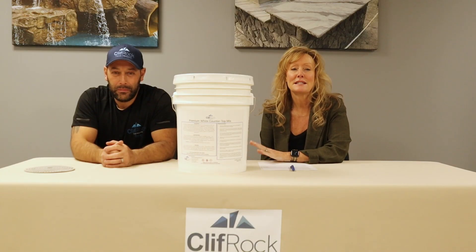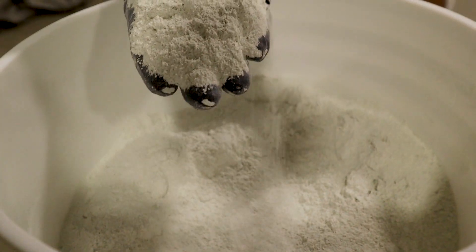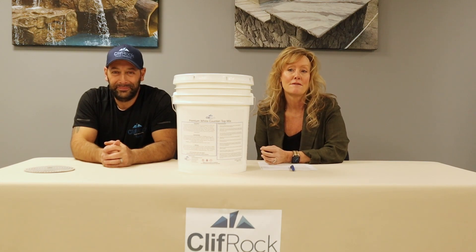This offers the very best blend of white sand and marble aggregates, white Portland cement, and proprietary admixtures. It also contains a specialized acrylic fiber network and the high flexural strength greatly limits the chances of cracking, curling, and shrinkage.